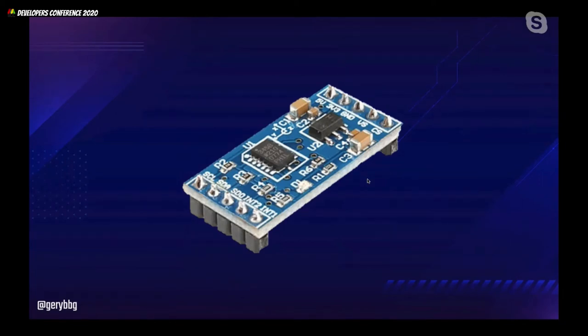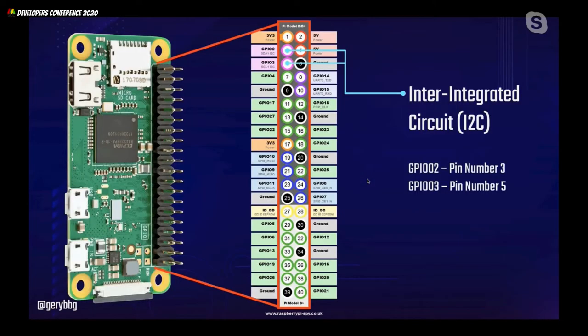Eventually I figured out it was just the pin I was using. The last part was the accelerometer — honestly the easiest part of this whole lightsaber. The accelerometer plugs into the I2C circuit and there are only two pins, marked exactly by their names on both the accelerometer and the Raspberry Pi. This one you really can't mess up — there's nothing that can break it.